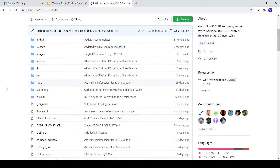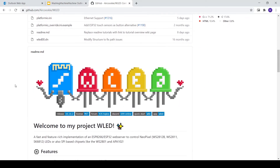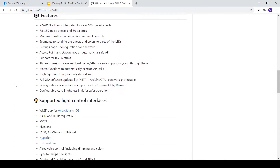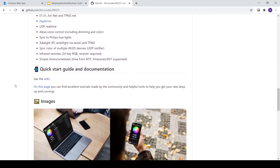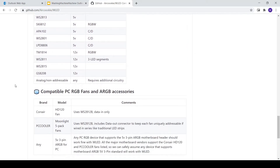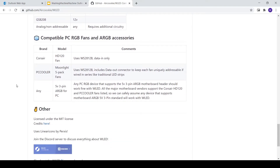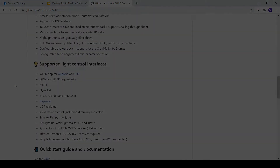In order to reduce the personal complexity of this project, we'll be controlling the LEDs with a popular ESP8266 software set called WLED. WLED is a set of software that allows for the easy and effective control of some popular RGB or RGBW LED chipsets, such as the WorldSemi WS2812 RGBs we'll be using. WLED's colors can be directed over Wi-Fi with several different communication protocols and methodologies. It also works with Google Assistant or Alexa for voice operated LEDs. We'll be using HTTP commands to control our LEDs today.